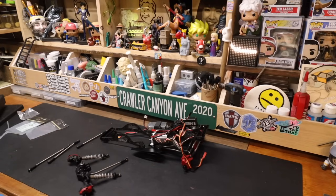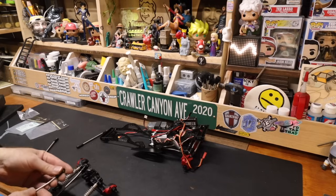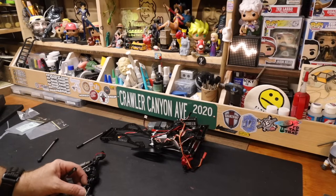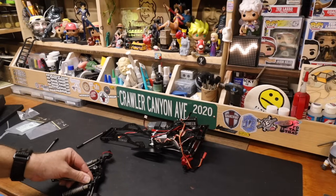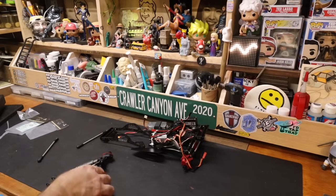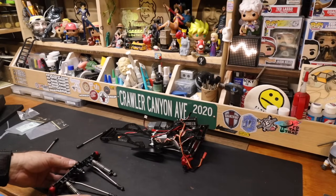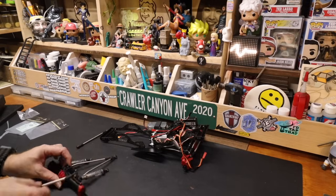because I never centered that servo before mounting the horn, because I didn't have a JST plug installed on the speed control to power up the servo. So if we power that up now attached, ask me how I know, there is that small chance that that servo horn is like 180 degrees off and it will try to turn that horn all the way around. And 50 kg. I don't know if I need to say anything more than that. 50 kg is enough sauce to do absolutely that. It will do its very best to spin itself around.